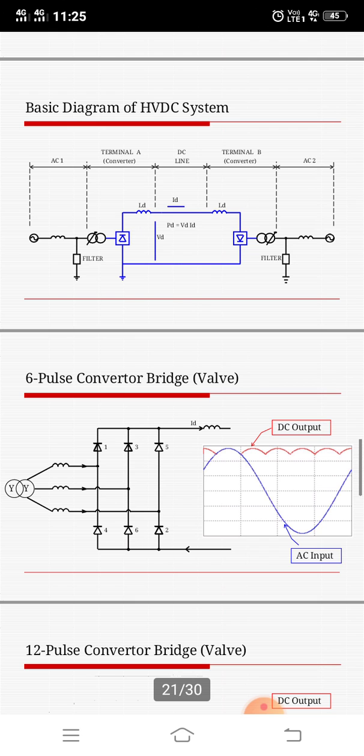The valves are cooled by air, oil, water or freon. Liquid cooling using deionized water is more effective and efficient and results in the reduction of station losses. The ratings of the valve groups are limited more by the permissible short circuit current than steady state load requirements. The design of the valve is based on the modular concept, where each module contains a limited number of series connected thyristor levels.